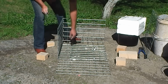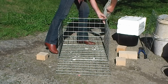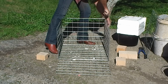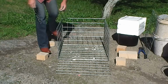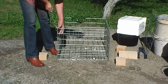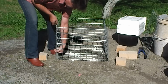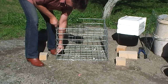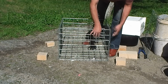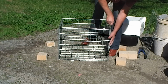This Gabion planter that we're building today is 24 inch or 600 by 18 inch or 450, but we have hundreds of sizes available. So this is just a nice easy size to work with. We're using the 4.5mm welded mesh, or if you're Imperial, the 3/16 welded mesh. And the last helical is just about to go in. Now the cages are just a little bit loose while we're assembling them, but that's normal. As soon as the rocks go in, it'll all tighten up.